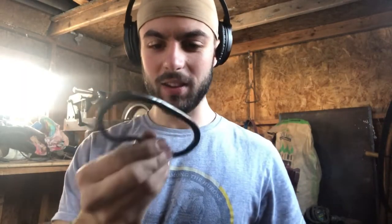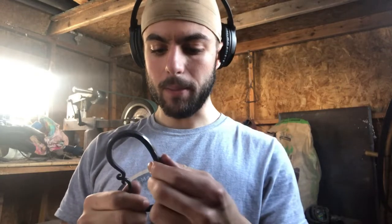Alright, well, it came out a little bit larger than intended. Now, the last step of it that I did was heat treating, and that's sort of the most complicated part of this process. So I heat treated this beyond critical temperature, and I actually didn't give it any temper, so it's potentially quite brittle, so don't go throwing it around off of brick walls, I guess.